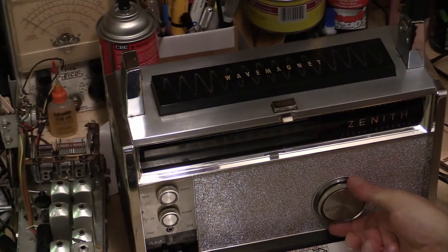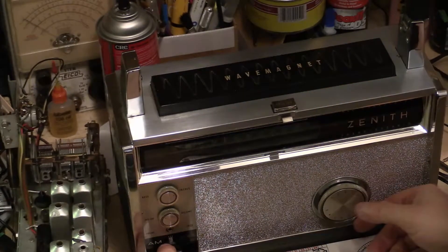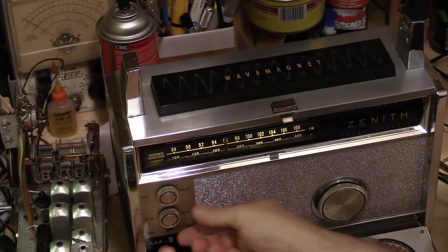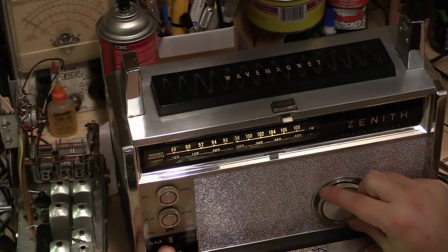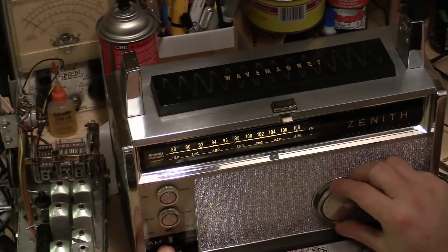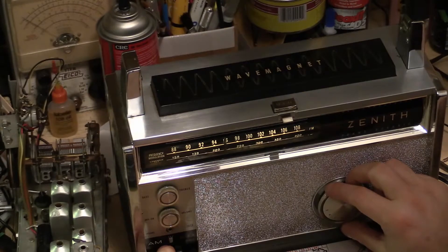I don't really know if I'm going to do anything with this right away. The dial pointer looks like it's off just a smidgen — the chassis may have to come up a little bit. I've barely got the antenna up. It does need to be aligned. Right now it's reading about 97.5 but the station coming in is 98.1, so it's definitely off. And 97.3 is coming in around 96.5, and 96.5 is coming in below 96.